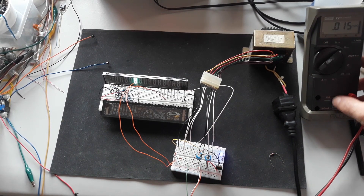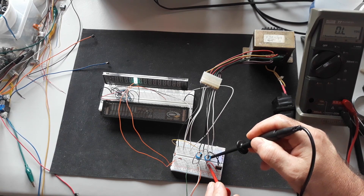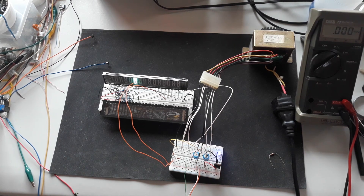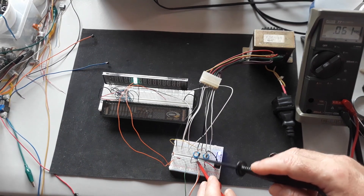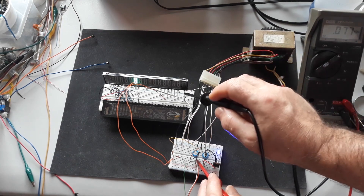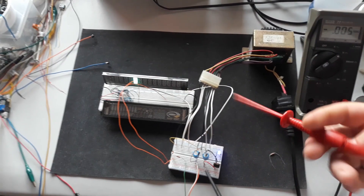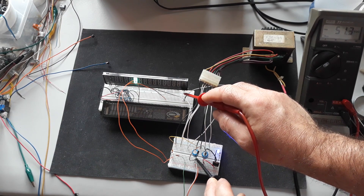Changing to DC, you can see here on this capacitor 30 volts, and on this one something like 50 volts. Now if you make the connection of the plus here — the 50 volts — and here at the filament, you can see this is a negative voltage, and you can see 50 volts. If I reverse the multimeter probes, you see it marks minus 50 volts.